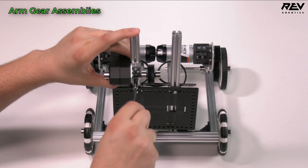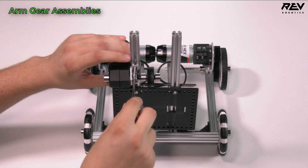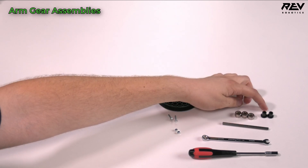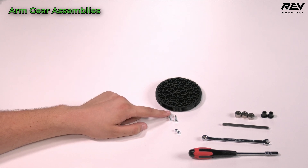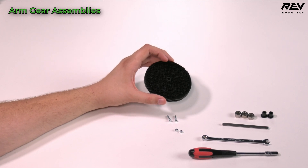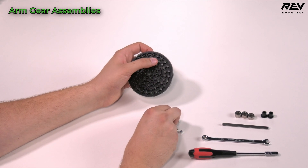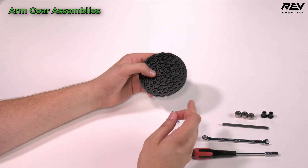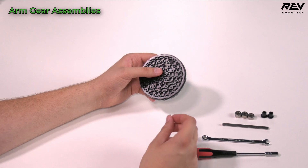I'm going to loosen it a little more just so I can slide it, then lock the outside too so it stays in place for now. Continuing with our arm assembly, we're going to need long bore bearings, three shaft collars, a 5mm by 90mm long shaft, 16mm long M3 hex cap screws with accompanying nylock nuts, and our large 125-tooth gear. You'll notice the gear has a radial hole pattern on it. This is going to depend on what your mechanism is — we're building a default arm position, but ultimately you'll have to decide how this mechanism works. This is a guideline and a good place to start, but you'll likely change it depending on what you're trying to accomplish.